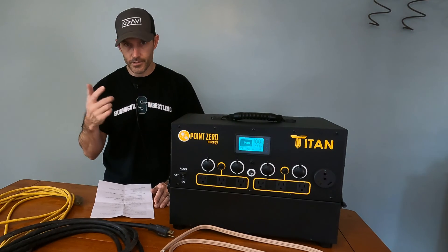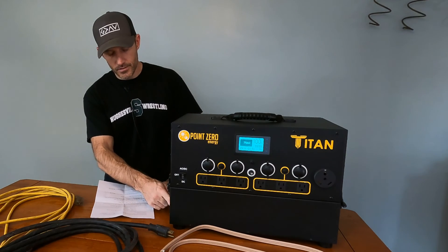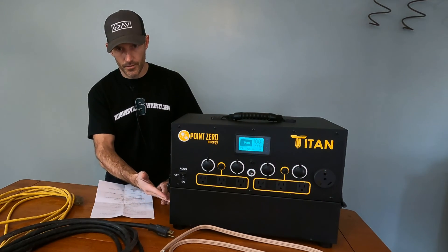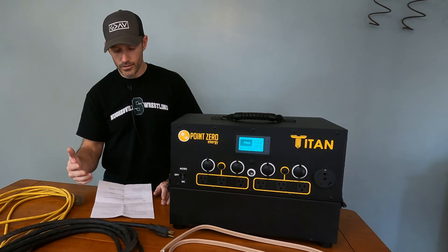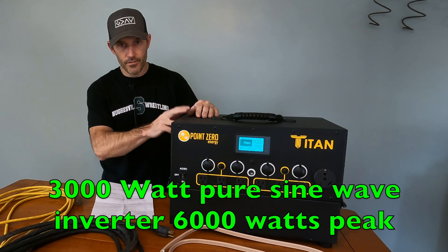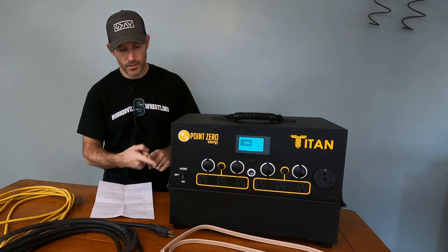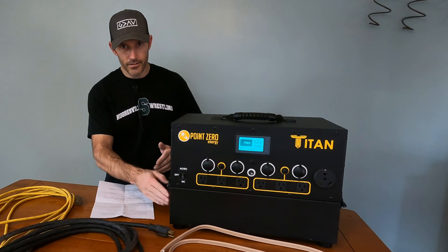With this setup I could power a lot of stuff in my house for quite a few days, even with some cloudy days. The battery is separate, and you can stack 10, 15, or 20 batteries on this. If you put five or six batteries on here with 4,000 watts of solar panels you'd definitely be good to go. They recommend with only one battery to run no more than 1,500 watts continuous, which makes sense — running too many watts would kill the battery quickly.